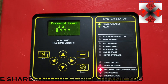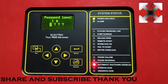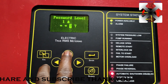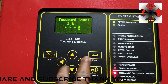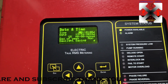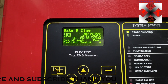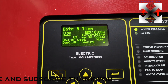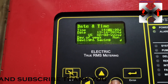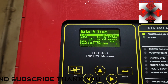For this stage I'm going to go through the Level 1 password. When you open the controller itself you can find the Level 1 password there. Once entered, to set the date you just use the up and down arrow keys to move forward and switch through the values, then press Enter when done.